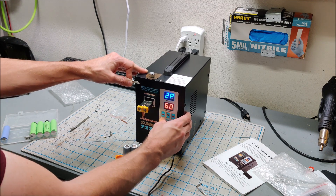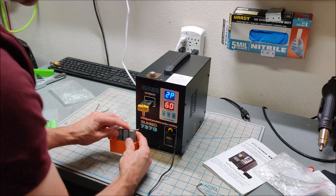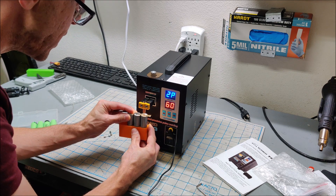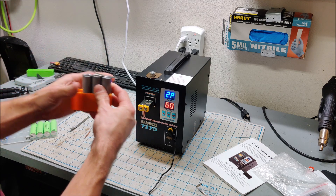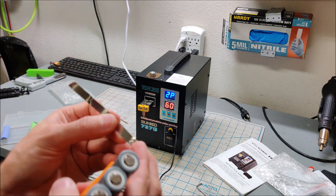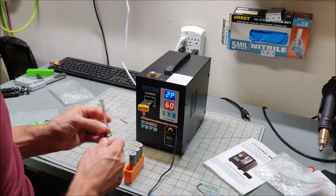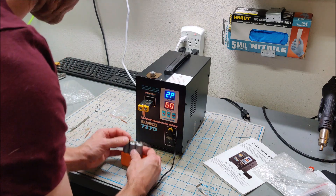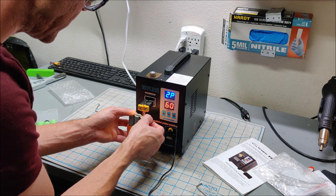Let's go to 60 percent current and see how that does. You have to activate the arm with the pressure and then push — okay, there we go! That is a good spot weld. It actually ripped holes in the nickel, which is about as good as commercial batteries. The foot pedal is a little awkward — you're getting everything right with the needles while also managing the foot pedal — but let's finish this battery and do it right.